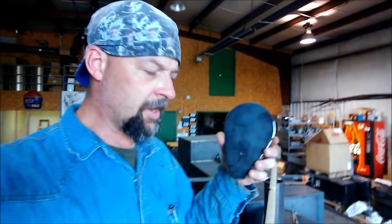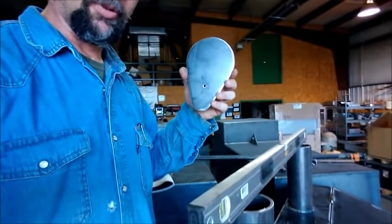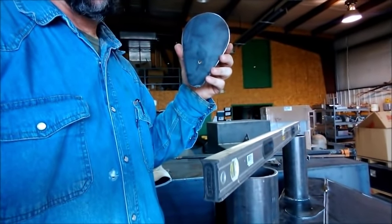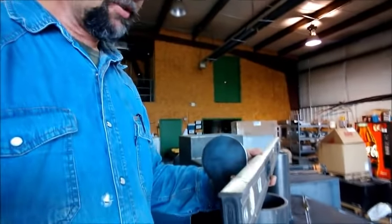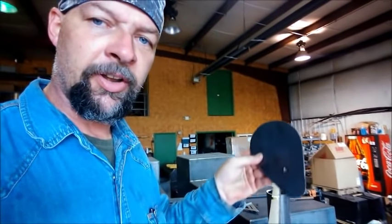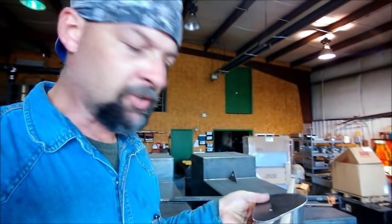What I've got here is this set up with two smokestacks on top of this grill — the same one we put the hinges on yesterday. The smokestacks are already welded in place, and I'm trying to find the center point of both smokestacks so that whenever I put my damper on, that bottom tab where my pinky's at will be lined up on both sides opposing each other.